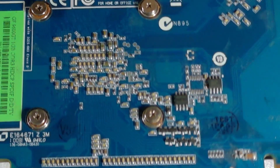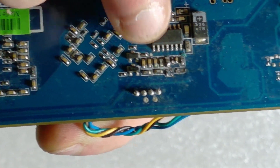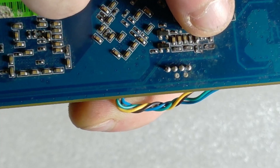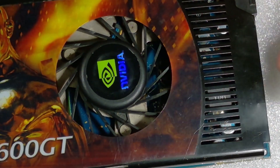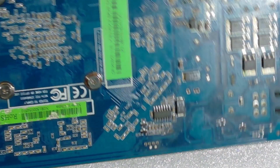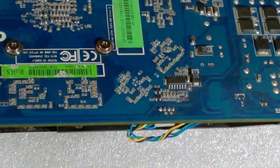The other damage on this is right here — yeah, so this is the other damage. Missing a component right there at the top; the pad is missing, so I'll have to rework the pad for it. That controls the memory, so the memory doesn't work on this. It just gives you a blue screen, green screen, kind of like a red screen — it gives an error screen basically for memory. That's basically it for this one. We'll have to fix that MOSFET and a couple of those SMDs. It's all surface mount stuff, so it's kind of nice to work with.